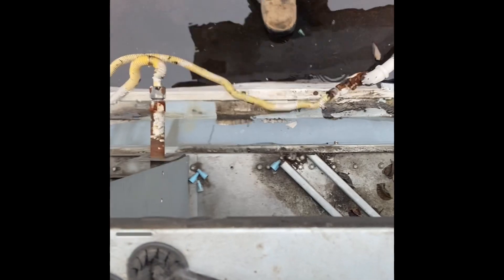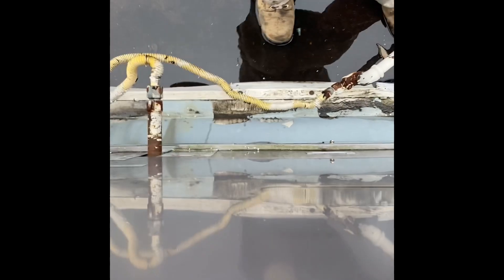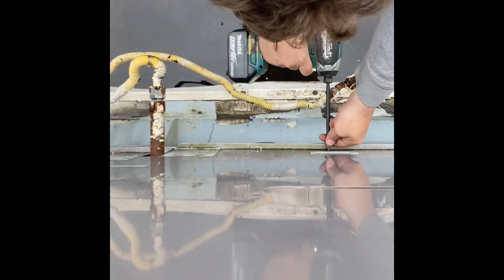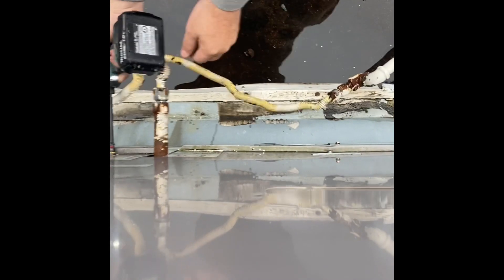The compressor's running right now, and I know it's not good for the head pressure, but watch that door snap — boom. That's a twin. They're probably one-horse motors — condenser fan motors up there. Definitely has a lot of airflow. And if you are working on these things live, you definitely want to be careful. Makita 18-volt brushless with a Malco flip bit — a wonderful tool.